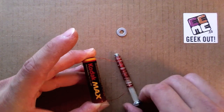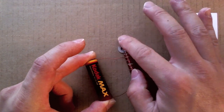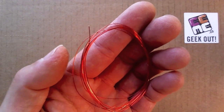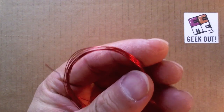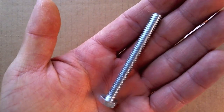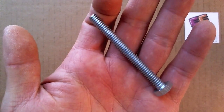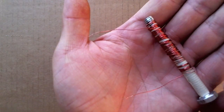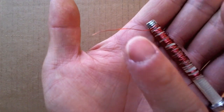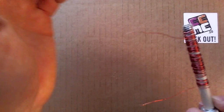But making an electromagnet is so cool we decided to make a small video segment about it in case your family wanted to try to build one yourself. The wire used is specifically designed to make magnets. It's super thin and is actually insulated despite looking like a bare wire. A steel rod that is susceptible to magnetic pull should be used. In our case, we decided to use a steel bolt you could find at the hardware store. After wrapping the wire around the bolt about a gregillion times and stripping the ends of the wire of insulation, we connect the ends of the wire to the battery.